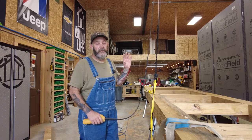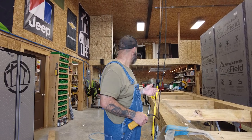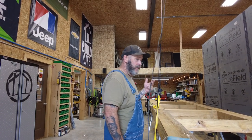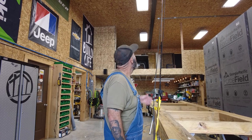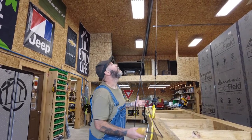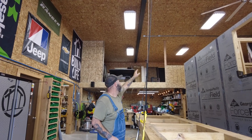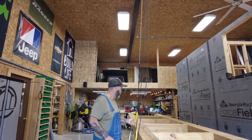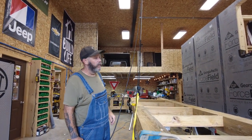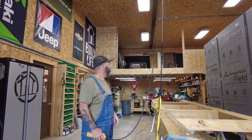We've got the frame of this half of the cabin's timber put together and we need to flip it over so we can seal it. I got a big wood chip in my eye — I try my best to wear glasses but that one found me at a moment of weakness. So I've got this overhead gantry crane — it's a beam that is through-bolted to a plate on top of the bottom chord of the trusses. It's got a synthetic winch line and a hook. We're going to pick this up and try to flip it over. I'm 85% sure it can hold, so we're going to stay well out from under it, go slow, and roll this thing down.